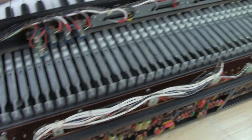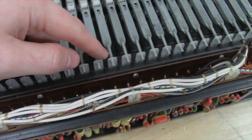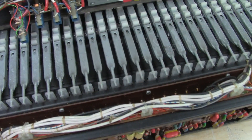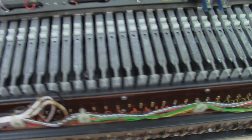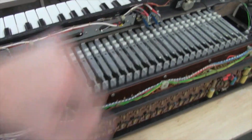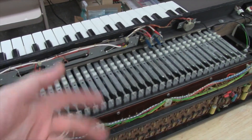You can see the top side here — the keys. It's got these long keys. Key contacts are back here, and it actually has a little actuation that's interesting. It's got a little piece of plastic that goes down with a spring contact, kind of like what you find on the Mini Moog. When you hit it, it pulls up on the bus. That was actually one of the problems this one had — it had a bad spring. One of the springs had actually broken off, so I had to replace one of the springs in it. You didn't have one of the bass notes — the polyphonic section worked, but when you played one of the bass settings, you had one note that wouldn't respond, and it was just a contact missing.